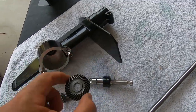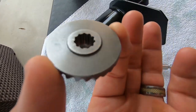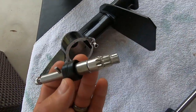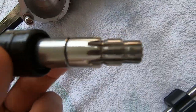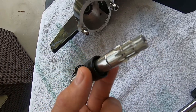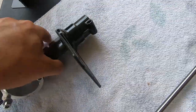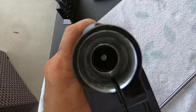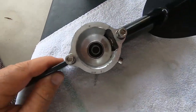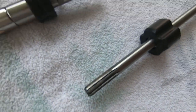There's a curved gear on both the pinion and the main spur gear. You'll see this is a seriously heavy-duty spur gear — it is not a cast piece, it's heavy. And of course in stainless steel here is the output drive shaft. You'll see where everything connects. It does have two TC seals, which are excellent seals, not the cheaper grade. If you look down into the foot, you'll see there's another seal that prevents the gearbox fluid from going up into the drive shaft, and it is a nine-spline connection.